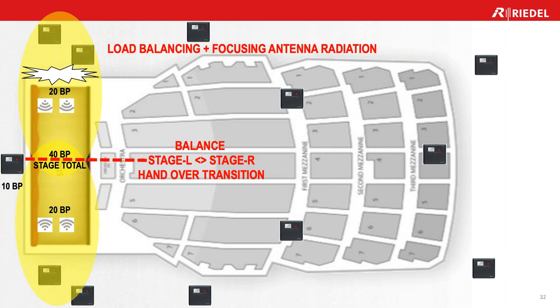But overall, that low power antenna will hardly ever get used if it's in an area with a bunch of high standard power. Well, again, you're really going to change the power level of the entire antenna group, not just one individual antenna. Now, if you have multiple antenna groups that need to be logged into and logged out of, and you had those located next to each other, then yeah. But the idea really is that you manage your antenna groups by area.